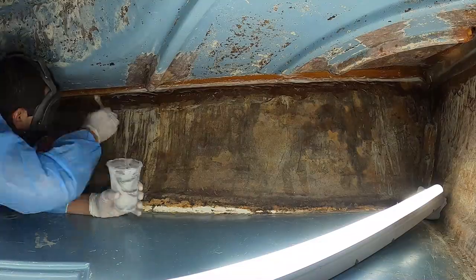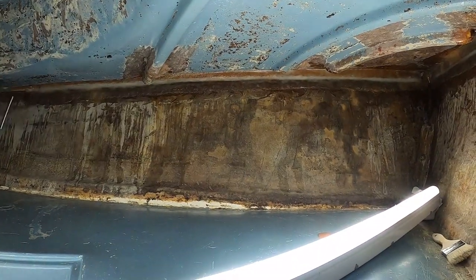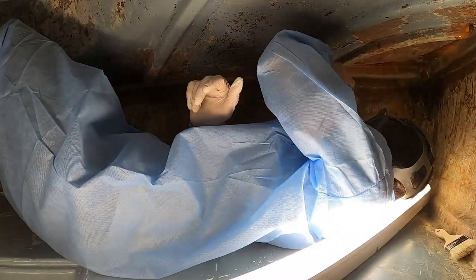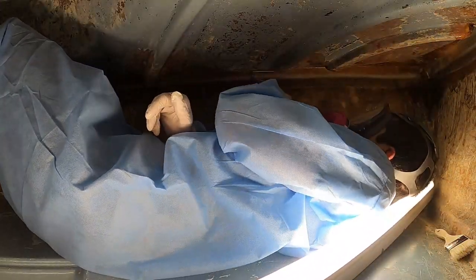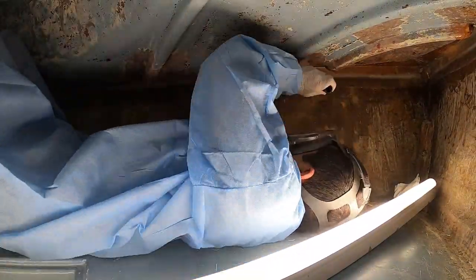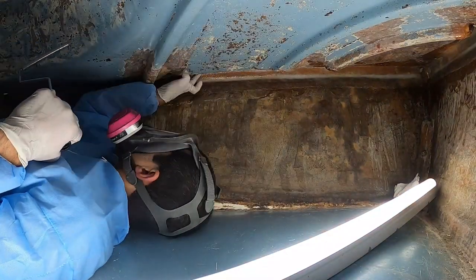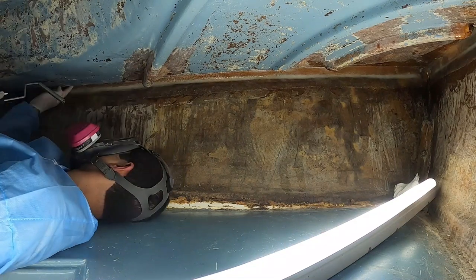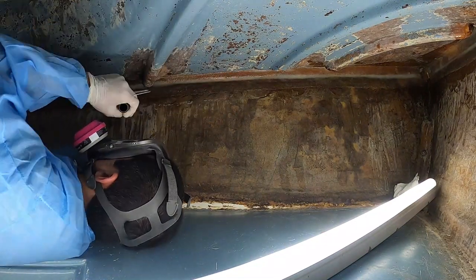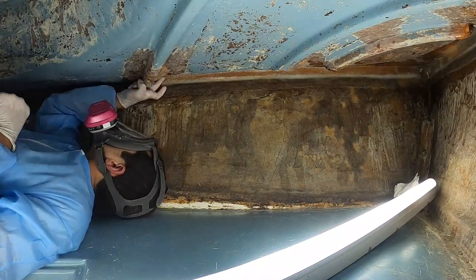I definitely went epoxy heavy, as you see with a lot of drips. So that's a learning curve for me, and partially because I did want to make sure that I had enough epoxy and I had no dry areas, but I definitely went a little bit excessive. If you have a nice interior or a nice area that you're working with and you don't want epoxy all over the place, you can definitely be more careful. For me, I'm a little messy, a little sloppy, at least in terms of drippage of the epoxy, but everything's going to get sanded down and primed and painted and all that.